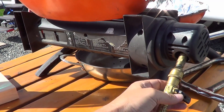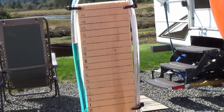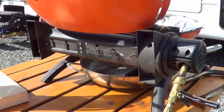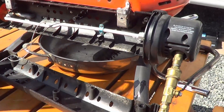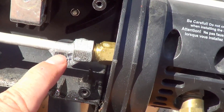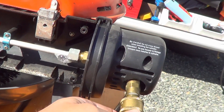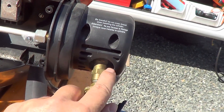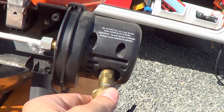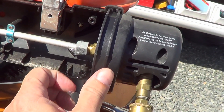After a little bit of troubleshooting, I've actually isolated my leak to the barbecue itself. I turned off the gas right at the barbecue and I can see the manometer dropping — so somewhere in the barbecue lines I'm losing pressure. Interesting, something I didn't even know about. That's why it's handy to use a manometer. Let's turn the gas back on — and of course we pop out. So somewhere in there we've got a gas leak. I'm going to pull the covers to find it. Found it! Using some leak detector, you can see we're bubbling right here on this connection.